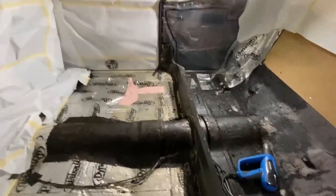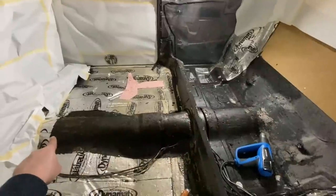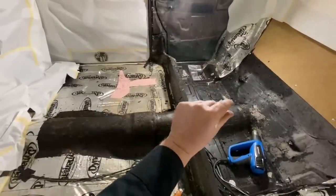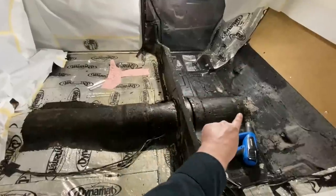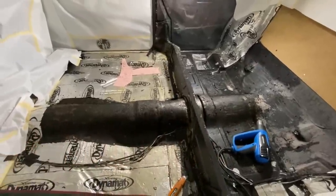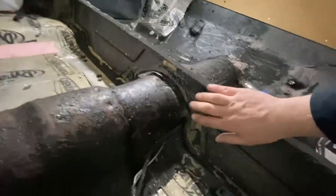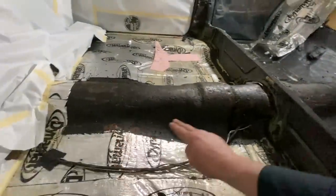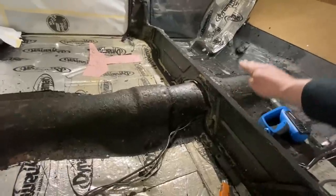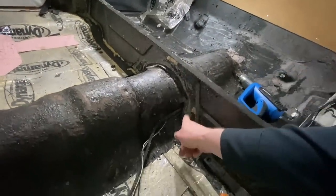I did this not long ago - Shannon and I did it in her Comet because her driveshaft was rubbing. Basically we just sliced from there to there and then opened it up. We moved the top or the back two inches higher and left the front where it was, creating like a wedge, then filled in the sides with a wedge-shaped piece of sheet metal. This one's a little more complicated because we've got some braces in here and this seat bracket. So I think to start we're just going to cut here and there on the other side, take this and set it aside, then lay out a nice line to cut, cut around the back and lift this up. Once that's lifted up and fit in place, we can trim this piece down and fit it again.